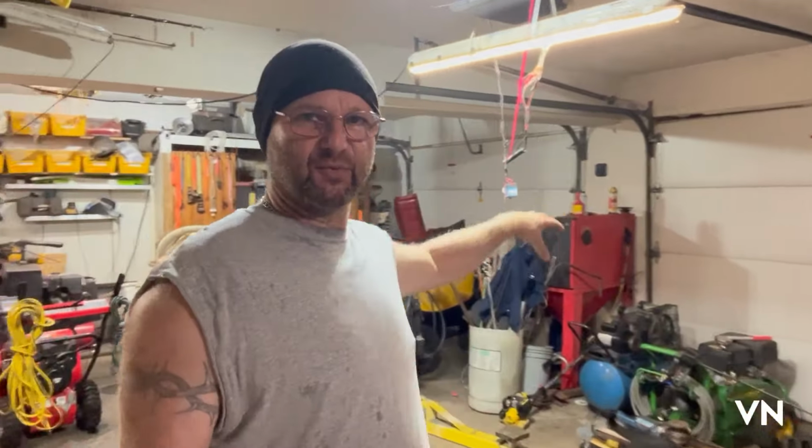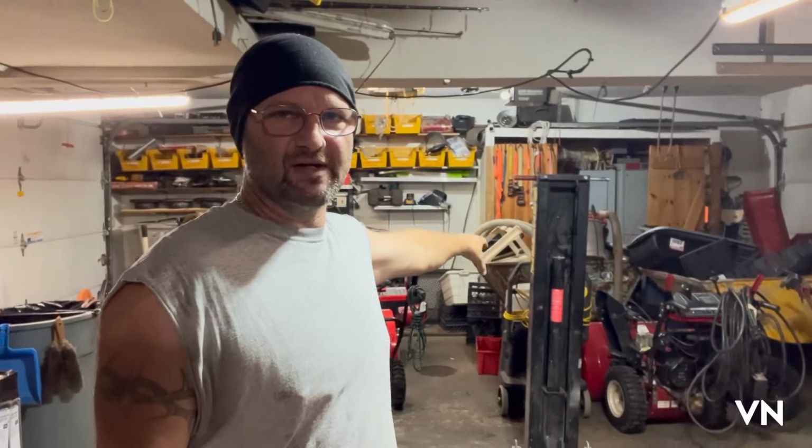So basically you drill the holes, you mount it there. And then if you want to move it to another location and you have other holes drilled elsewhere in the garage, like if I want to put it in the big bay over there, the longer bay, I can have a separate set of holes over there. I can just unbolt it. All the hydraulic hoses are quick disconnect. It's 110, unplug it, disconnect all the hoses, run the lifts over there, bolt them in the ground, and then I have them over there.